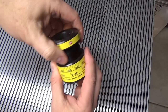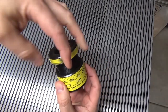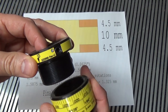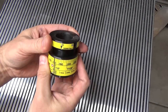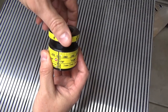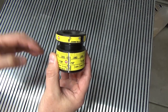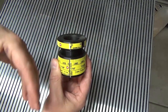It's made up of two collars — one internally threaded and one externally threaded — and they mesh together. The upper collar contains a set screw for fixing it into position on the leg of the main table. The thread pitch on this is 1/16th inch, so that means if I were to align marking D here with zero and make one full rotation, I will have changed the height of this collar from top to bottom by 1/16th of an inch. I can reduce the height, or if I turn the other way, I increase the height.